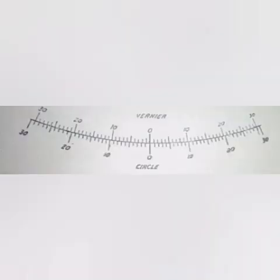In the case of a vertical vernier attached to the vertical circle of a transit, which is divided into quadrants, two sets of figures are marked on a single vernier instead of fitting a double vernier. In reading the vernier, that set is used which increases in the same direction as the figures on the quadrant which is being read.